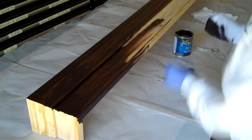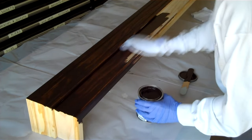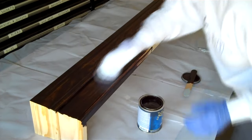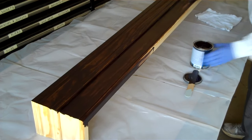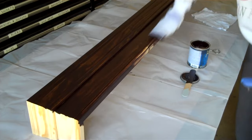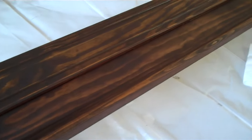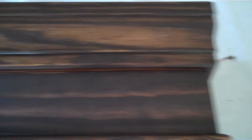That in essence is the coverage that I want for this piece. I still want the grain to show through, so two light coats is probably going to do it for me. After the first coat on the entire cornice, you can see there's a little bit of unevenness, and that's typically why people will go for a second or even a third coat. But because I do want to keep some of the wood grain obvious on this piece, I'm probably going to go with just one more coat to keep this nice wood grain.